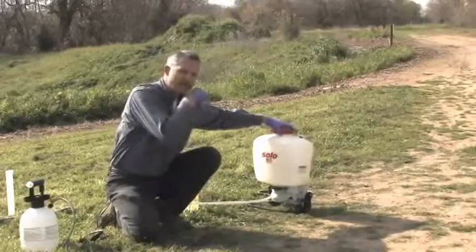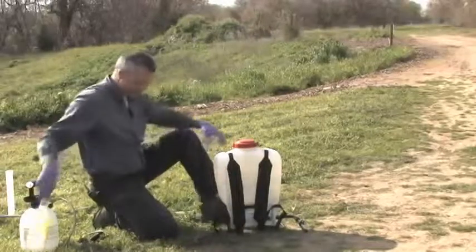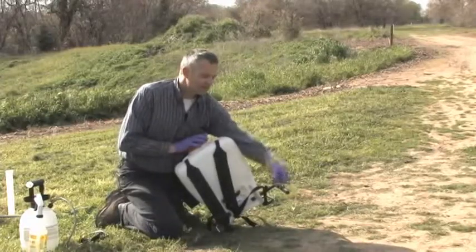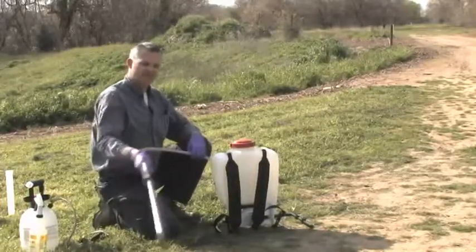The next step would be a hand pump backpack sprayer. You wear it on your back and can mix up to four gallons of herbicide, continually pumping to keep up a steady pressure. You can use that with a wand and nozzle to do spot treatments. Regardless of the type of application equipment you're going to use, you have to calibrate correctly.